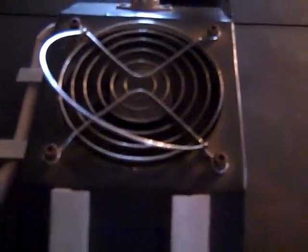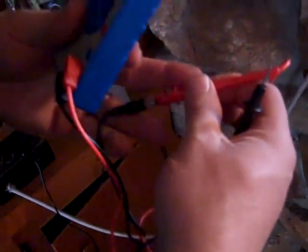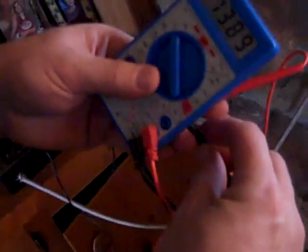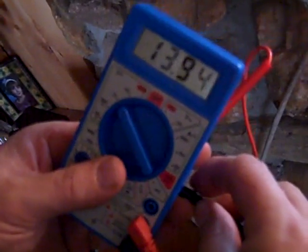I'm also using this 30-watt stovetop thermoelectric generator. What I'm doing is charging a battery using a 12-volt setup. I'm testing the voltage out of this battery — it started at 12.52 and is at 12.62 volts right now, so I know that I'm charging the battery. I'm going to measure the voltage coming out of the thermoelectric generator: we have 13.93 volts, so you know it is charging the battery.